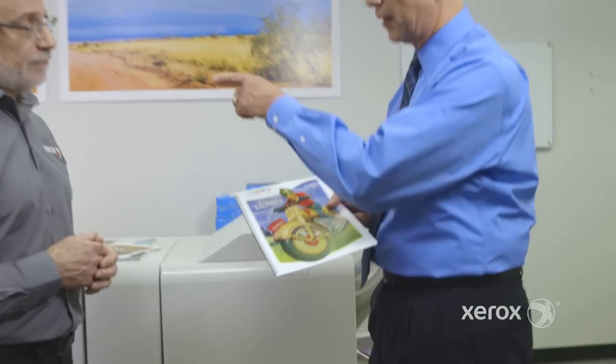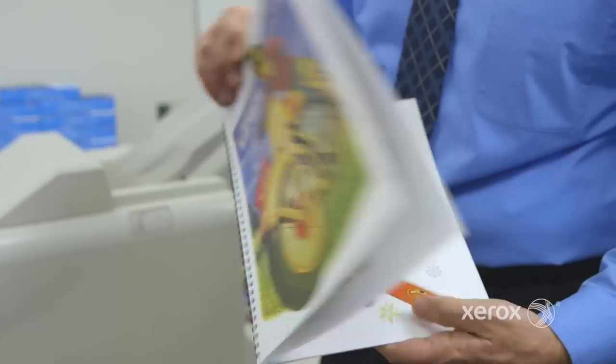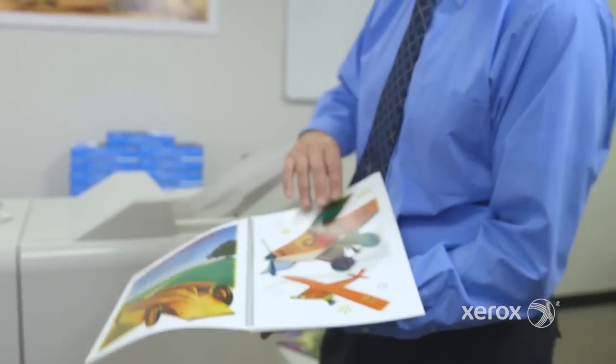I also love the GBC eWire. You use the punch, punch your documents, and they ride to the end and get wire bound. You can get different types of wire, different punches, different thicknesses. What's great is that this is one of the first instances of a fully inline wire booklet, which is a lay flat format. In the past you'd do this near line, but now you can insert covers inline and do all of those things while the press produces finished output — it's all about higher productivity.